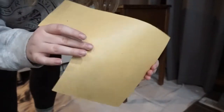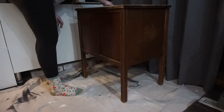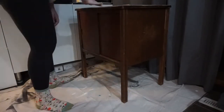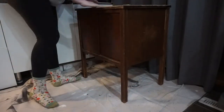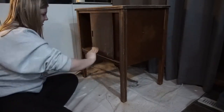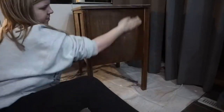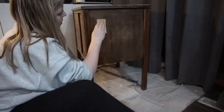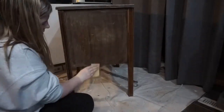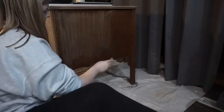I'll take a little bit of sandpaper and get every single surface of this record player stand. I start with the top. There are a bunch of grooves in the legs so I had to get all those as well. Here I am doing the doors, sanding down every single surface to make sure everything is smooth. I wanted the paint to stick in a smooth and clean way. When sanding wood, you want to go with the grain so as not to scratch it.